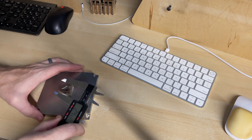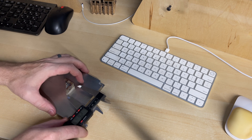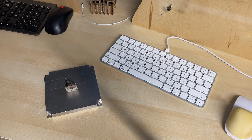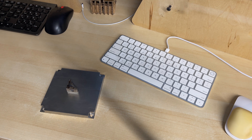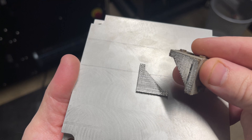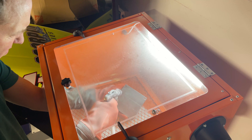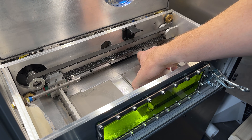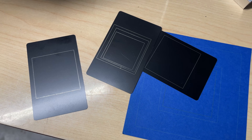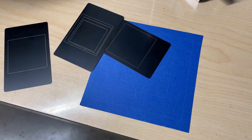I was doing some more inspection and measuring this part. This is supposed to be 27.8 millimeters — it's about 24.2 to 24.45 millimeters. So it looks like I need to figure out how to do the lens correction so we can get parts to actually come out to the correct size. I did a little software calibration and got it so that everything is scaled properly, so hopefully our parts will be the right size now. There still seems to be a little bit of lens distortion at larger sizes and I'm not quite sure how to add in the correction file for that yet.